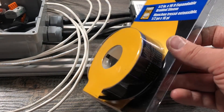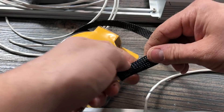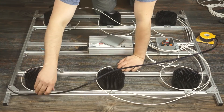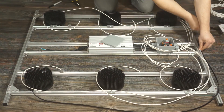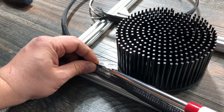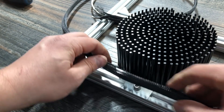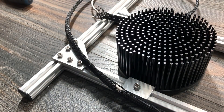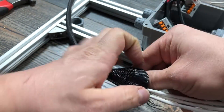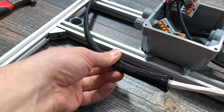In order to provide a little more protection to the wire and to make the light look a lot cleaner, I decided to sock my cable with this half inch braided sleeve. The half inch size fits three 18-2 cables nicely. I had to poke the cable out for the first couple lights in the chain, so I used a lighter to burn holes in the sleeve at the locations I needed to pass cable through. Burning this stuff is better than cutting it because it won't fray. If you cut it, it turns into a big mess pretty quickly. You are going to have to make some cuts though, and to clean up the frayed ends on the sock, you can just fold it back in on itself for a nicer finish.